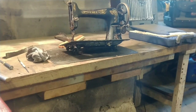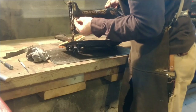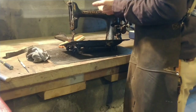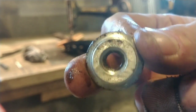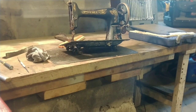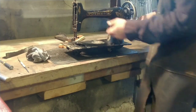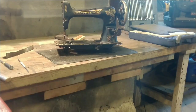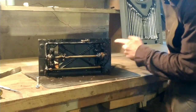Going after the tension assembly — something is not right. I apologize, I'm still developing my video style. The tension wheels look pretty good; there's a little rust on the lower part where moisture sat between them. What I'll probably do is just turn them over and put that rust up, so the smooth portion of the tension discs will be the working face. Now I'm going to use lily white sewing machine oil.